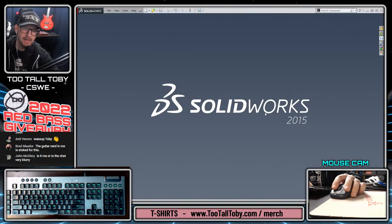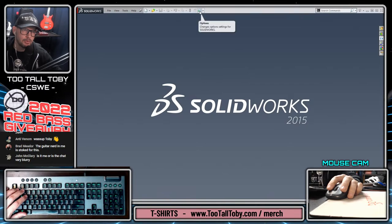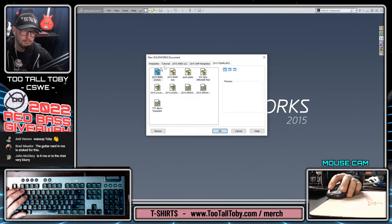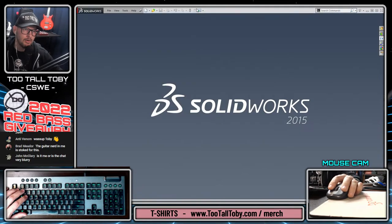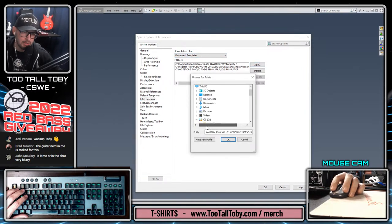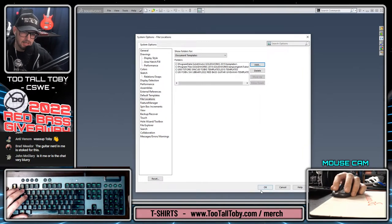A lot of people ask about that in the comments, so I figured I'd just spend 10 minutes and go through it real quick. The other thing that I want you to know is that once you're done doing that, you have to remember to go to your options and point to that template. Otherwise, when you click new, you're not going to see those templates. I don't see that 2022 bass guitar giveaway template tab. So I'm going to go options, file locations, and then I'm going to say document templates. I want to add the new location that I just was pointing to. SolidWorks remembers where we just were, which is pretty nice. So I'm going to add that location.